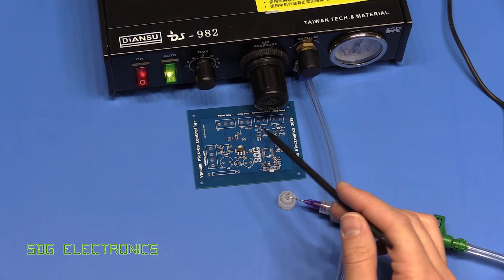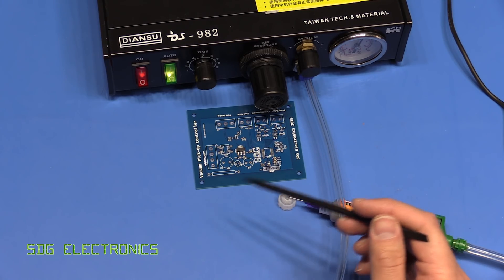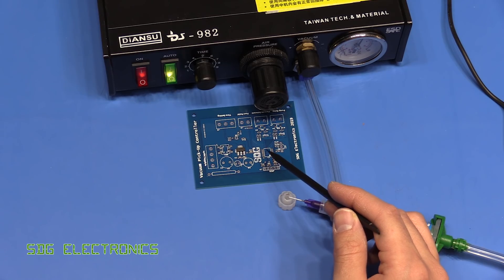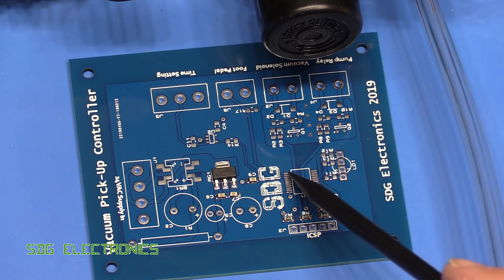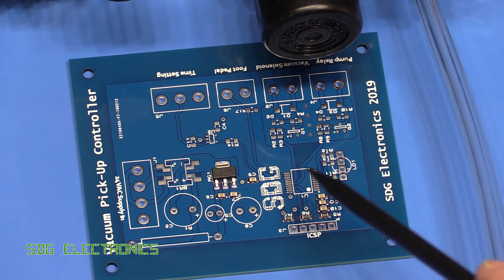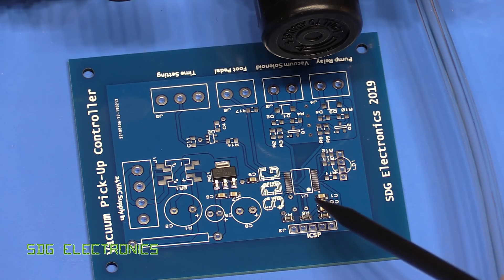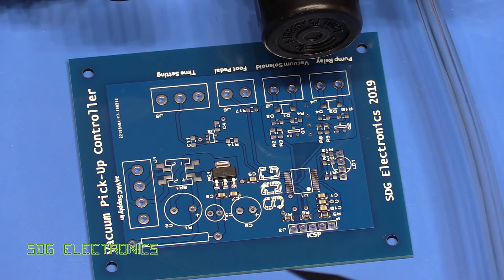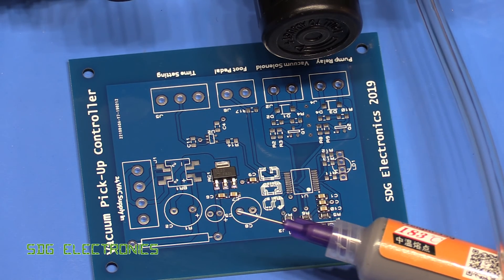So that's a quick look at assembling a PCB with one of these solder paste dispensers. It did appear to be quite a lot quicker than assembling by hand with a soldering iron. Unfortunately I've run out of time tonight to assemble the whole board. I'll be interested to see what happens with this SSOP package because the pin pitch is quite tight — we might be able to run a sausage of solder paste across the pads and place the microcontroller on top, but I suspect we'll end up with some solder bridges. I also noticed the solder paste flowed a lot better this time — I think we may have had the dry end of the syringe last time.